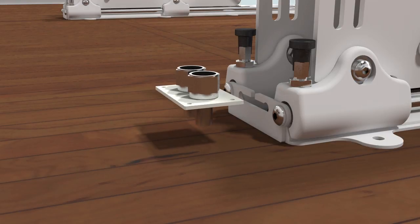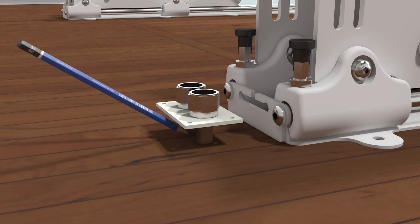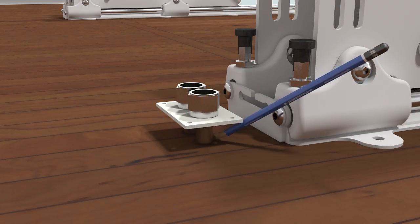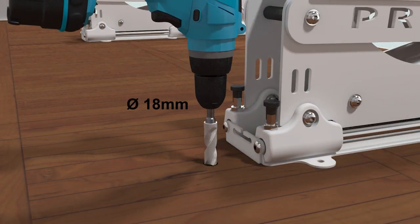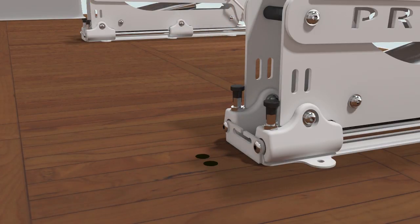We'll be showing you an installation as per Alternative 2. Use the through-hull fittings as a template and mark the drill points. Thread the hoses through the swim platform and connect them to the through-hull fittings, making sure that the sealing ring on the hose coupling doesn't slip off.